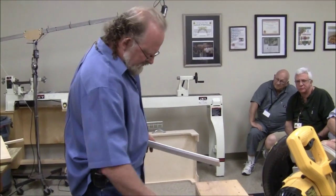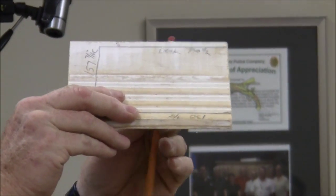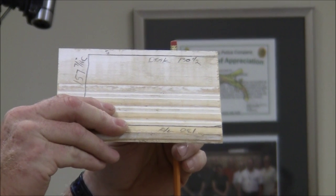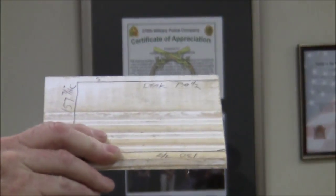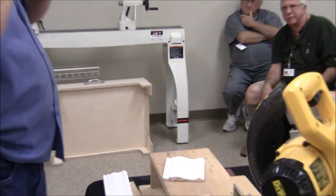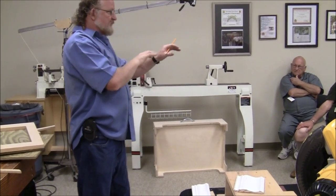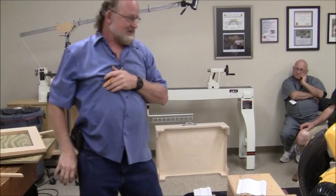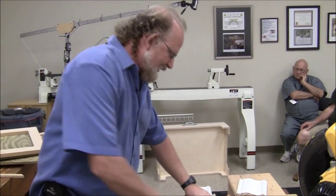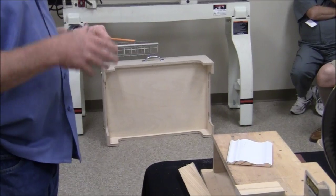That six inch crown — I bought it at the depot and it doesn't really give you a lot of bed. When you do bed this properly and you've got your flats hitting, this angle here should really be plumb if it's correct. But this thing, when it beds, it's not plumb — it's kind of out of plumb, which makes it a little bit more difficult. Because when you're coping, you want to cut your piece a little bit long, start in the middle, get it nailed off, come back over to the edge where you're going to force your other piece in, fit your piece up where you want the cope looking good, push that piece up in there. And if you've done it right, that sharp edge of the cope will cut into the other piece and it looks like it's grown there — no filler, no caulk, it just looks great.